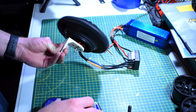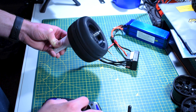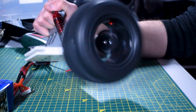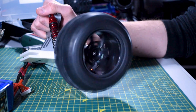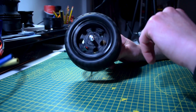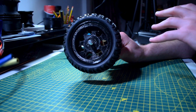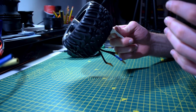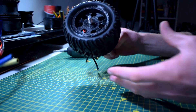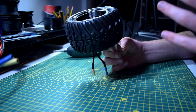I even ramped it up to full speed — for this particular test it's working. For comparison, a clip from a previous video shows a serious amount of vibration with the tire basically falling off the alloy. The bead-locking alloy is a really big improvement. I was especially happy with how freely the wheel spins and how little vibration there is compared to the previous setup — before I could barely hold on, it was vibrating so much. Even without the gorilla tape, the clamp was still holding the tire onto the alloy.